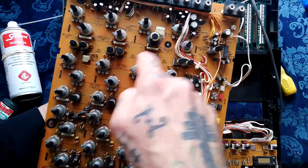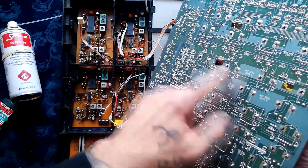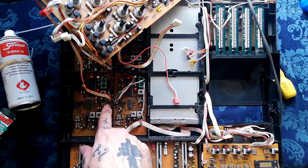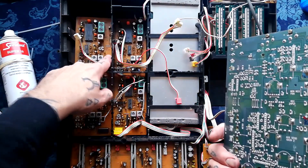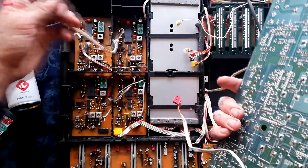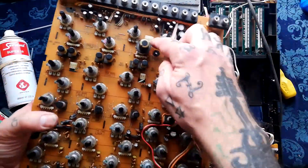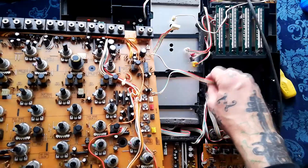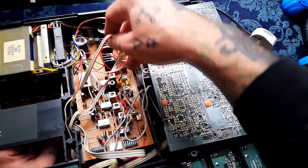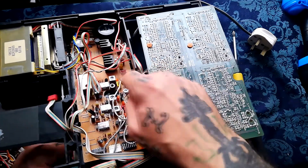I've knocked off a clip there - I'll put that back on. It tips from that side and comes out of a lip there. So let's see what we still have connected: two points going into a four-pin cable going underneath. Our cables are passing through holes, and two headers through those holes. The cable here is terminating on a red plug, so that's our record/playback board under there. We had this one cable coming from the corner, and these three short cables are either different colors or different pin numbers, so that should be easy enough to match up.